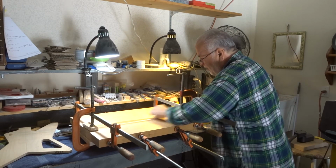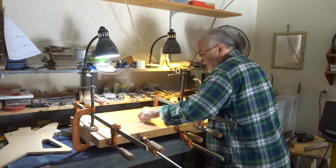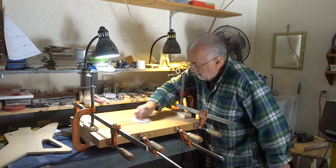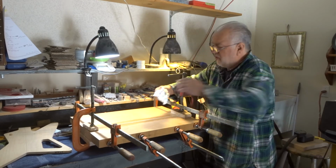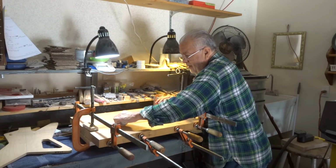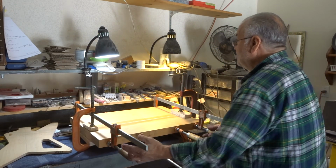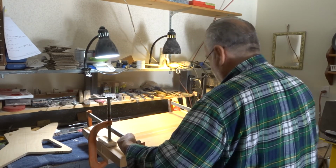The reason why I like to wipe off the glue is because in the long run, it's a hard material when it's dried, and it can mess up your cutting blades on the machines that you have. Like, I'll be running this through a thickness planer, and I don't like to leave big chunks of wood glue there. Those blades will eat right through it, but let's save some of the blades on those machines that we have. So there, I got most of it wiped off. Let me lift this up. It's going to be pretty heavy now, so be careful.